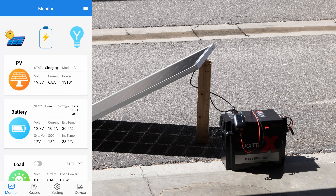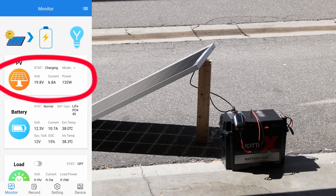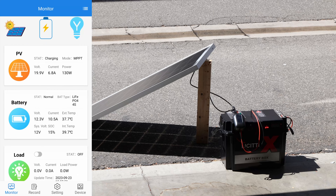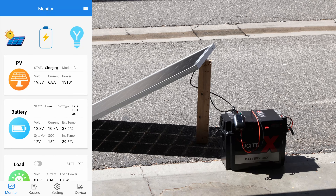Because it's a 12 volt battery, 120 watts is the maximum. The MPPT charger is a 10 amp unit, so that's the maximum it can push into the battery — and it's pretty accurate. Up there you can see PV is at almost 20 volts — 19.8 times 6.8 or 6.9 should be around 130 watts, and it needs a little of its own power to do the magic of pushing the watts into the battery. The solar panel is the bifacial panel from EcoWorthy, capable of at least 150 watts and rated up to 195 watts.